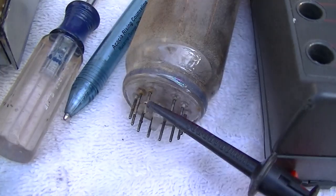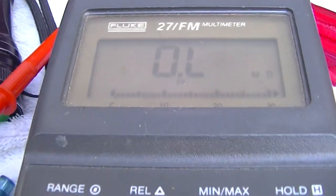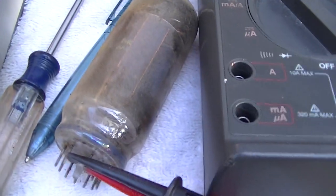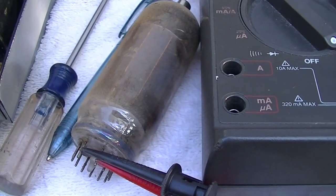And attaching an ohm meter between pins 1 and 12 yields open. So, unfortunately, vacuum bulb exceeds value of television.